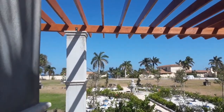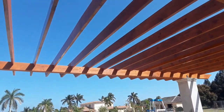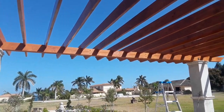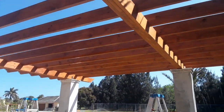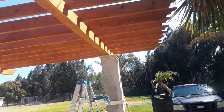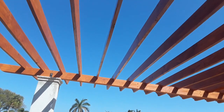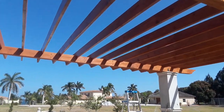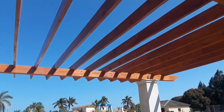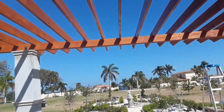Let me show you where I'm at with my pavilion project. I got a second coat of stain on all this stuff and now I'm starting to varnish it — up to about where the ladder is. I'm doing one side in the shade and then as it gets later in the day I'll come back and do the other side, so it's not in direct sun and the varnish doesn't set up too quick and leave brush marks. It's moving along and actually looks like something's getting done.